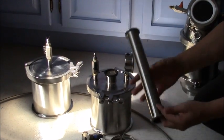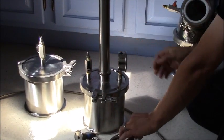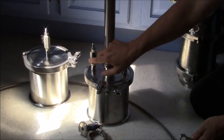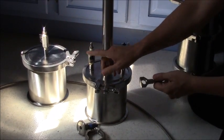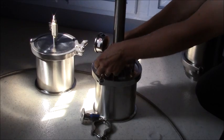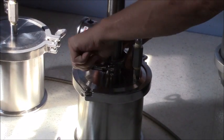Go ahead and take the clamp — it's got a groove cut inside. Match it up, make sure it's in place, and feel it to make sure it doesn't move or slide. Take your clamp and go ahead and do the same thing that you just did down here, but only right there. Try to make sure your clamp key is away from this valve. Otherwise it could mess with your fingers and stuff like that — it's just a good tip to make sure the key is away from the valve.